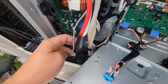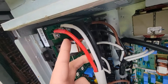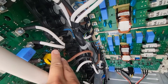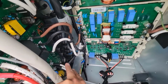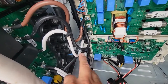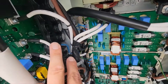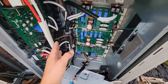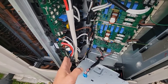Let's go over the wiring real quick. We got one compressor coming into this inverter board, and then one compressor coming into this inverter board. The two white wires on this board come from this reactor, and then these two white wires go to this reactor. We got the reactor wires into our inverter board, and then the white, brown, and black from the EMI board go to this inverter — same thing for the other inverter. So basically: input from the EMI boards into the inverter, reactors into the inverter, and from the inverter we go to the compressor.